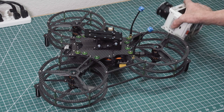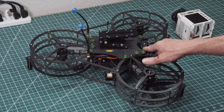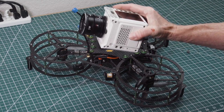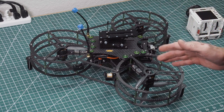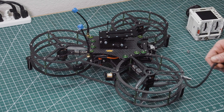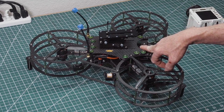Powering your camera: this bird includes a step-down or UBEC for powering this XT60, which then can be used to power your camera. In the case of the Red Komodo, it uses 12 volts — a very rational voltage. Some cameras like Sony use like 19.5 volts, but for most cameras this UBEC will work as is.